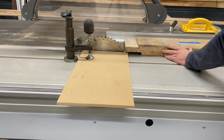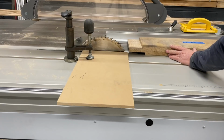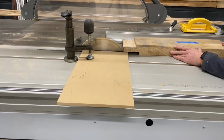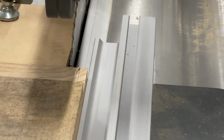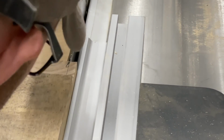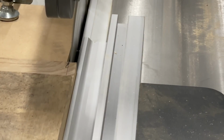So obviously we don't want the ends of the tenons coming to the edge of the door, so I've just got a little bit of a template set up here just to haunch them in. We all work on the basis of sneaking up to the line, but having one of these automated saws, this Altendorf F45, takes it to another level. It's literally pushing the workpiece over until you get it onto the line. Unbelievable. I love it.